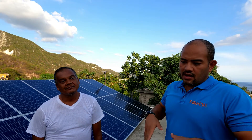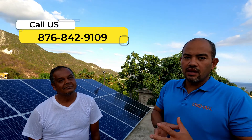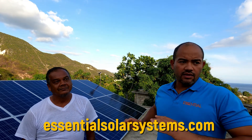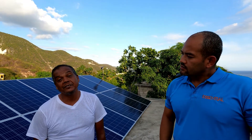It's a system you take time and build. You can start - get a good inverter and start, then add panels and batteries as you go. You want to at least get the correct inverter for your needs, and then you can add your batteries and panels as you go. Make your savings as you go and invest in your system. Yes, because I manage it well - I don't make them overdo nothing at all. Anything I do, I monitor it.